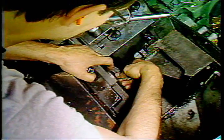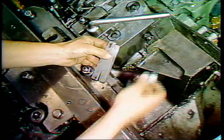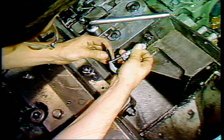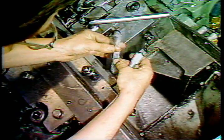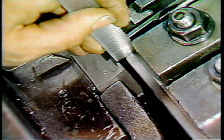If at any time during setup you find more than three shims under a die, remove the shims. Hold them together and measure the total thickness. Then select a single thicker shim or a steel plate of equal thickness to replace them. Adjust the die packing under the moving die until the tops of the dies are flush.